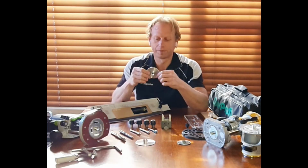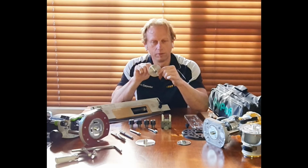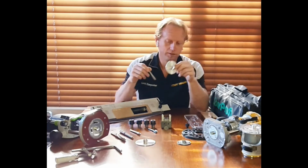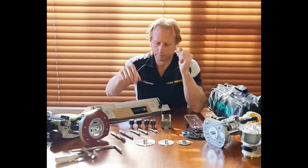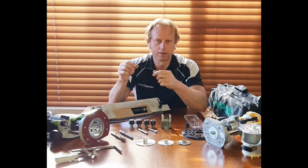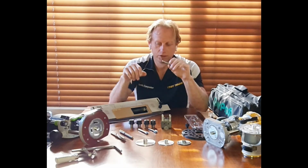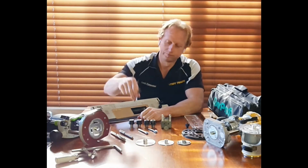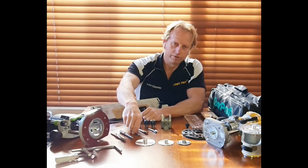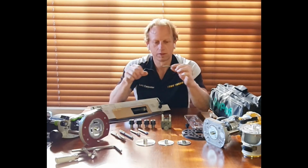We want to use a 16mm copy ring with a 12mm cutter, creating a 4mm difference. That's 2 either side. And that's how we work with these templates. So to work with the Festool router and the 17mm copy ring, we've imported 13mm cutters, which creates a 4mm difference. These have 8mm shafts, so you're going to have to get the collet to suit each cutter that you use. The common sizes that we have in Australia is 1/4 inch, which is 6.35, which is a thin shaft.